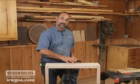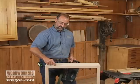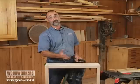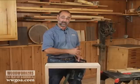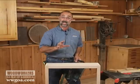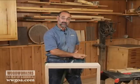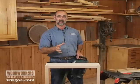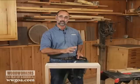If I didn't have it and I was working on getting this down, I might have taken too much off of this side, suddenly have sanded through the veneer, and then this project is no good at all because you've got to sand through. So with those tips, I think that's going to make it a lot easier with practice for you to get the hang of using the belt sander. Once it becomes your friend, you're going to use it all the time. It's a very, very good tool to use in the shop.